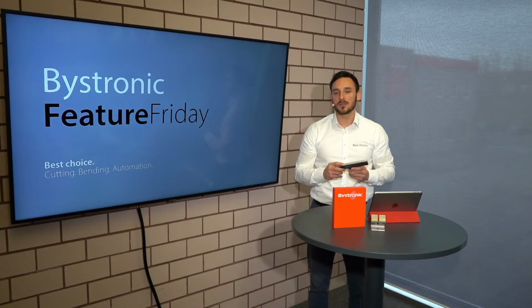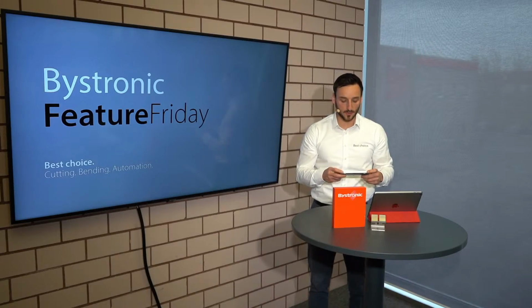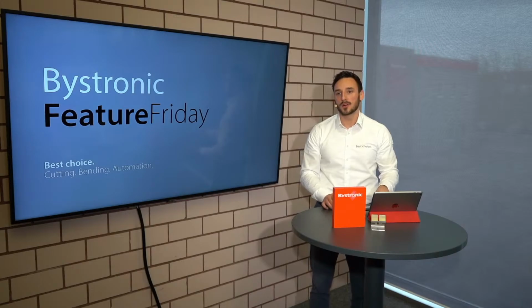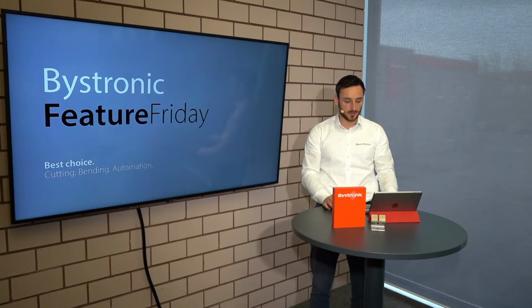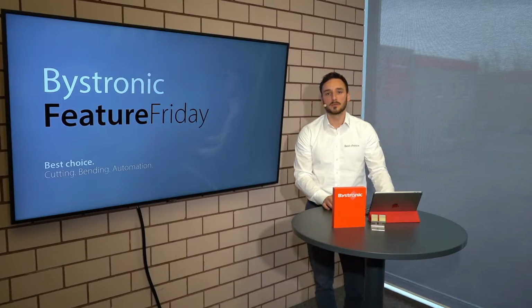We have the system also with a Bluetooth connection to the bending machine, which makes it very easy to measure an angle, transport it to the machine, and use this angle for a direct correction for the following bends. So it is an easy, connected way to measure angles and use these measured angles for the further bending process. I will shortly have a look at the chat for questions. At the moment there is no question.